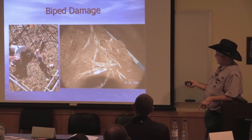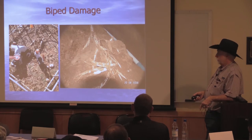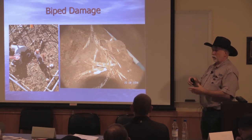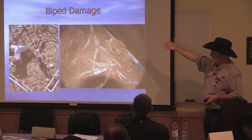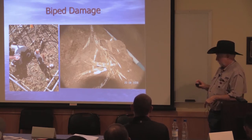And have y'all ever seen PVC pipe after a water hammer? That was 6-inch, 80-pound pipe before the water hammer. We dug that up, and I couldn't believe it. A lot of those pieces were almost 40 feet long, but it looked like they were spiraled. I guess that extruder has a twist in it, and it was just shredded. I think he blew out 3 joints of that.